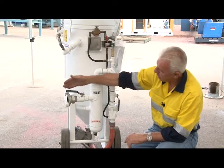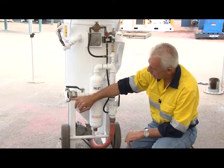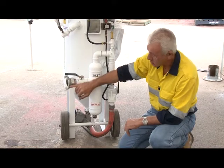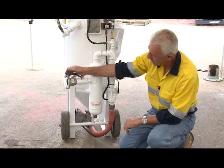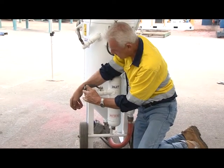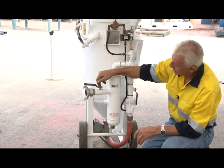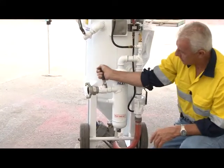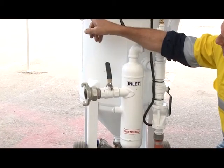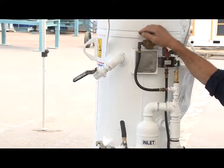To keep you safe, what we do is we attach the bull hose on here, and again with any bull hose — two inch bull hose — we put safety pins in either side. Not just one, we always put two. We check that the gasket is concentric, it's flat on the face and it's in good repair. With this valve, we always have this valve turned off when we're attaching all this. And we always make sure that this valve in this particular pot is always open when it's not in use.